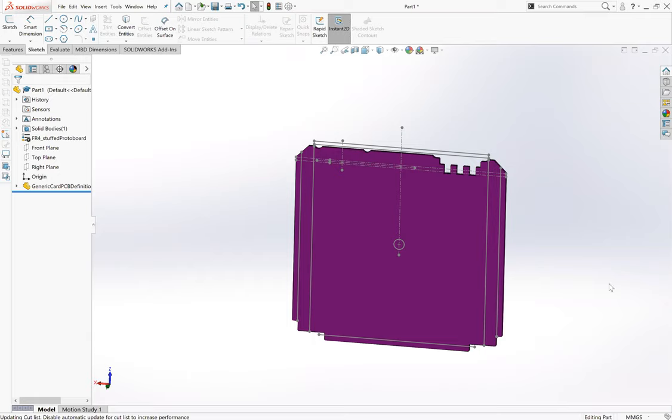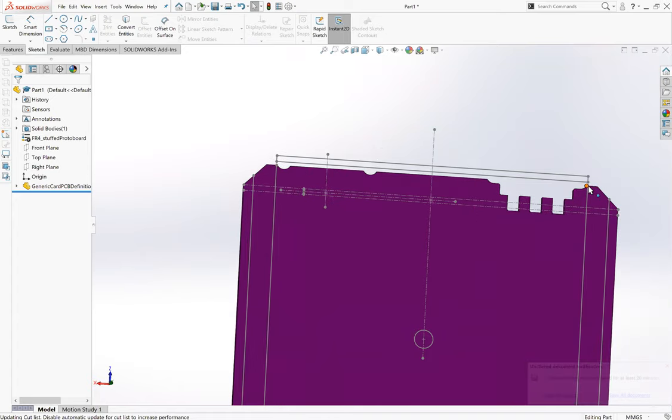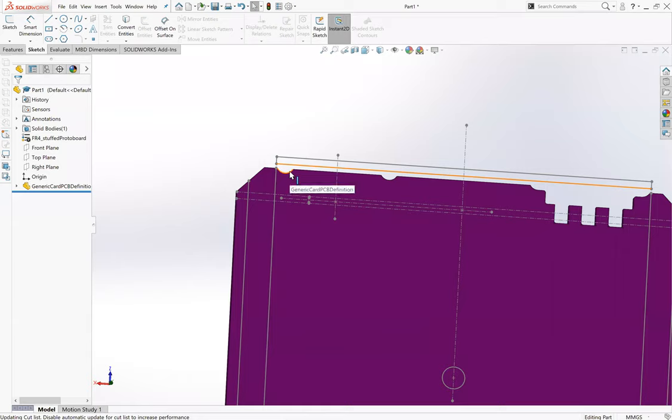The next step is to add components. To go into some details: we've got these 45-degree chamfers on the card to match up with the negative-X frame chamfers. This essentially acts like two ramps to really get that card centered and perfectly inserted into the frame. We also have those RF cutouts - we might not use all of them, but it's good to keep them so we don't accidentally place something where an RF connector needs to go.